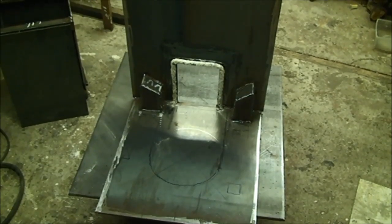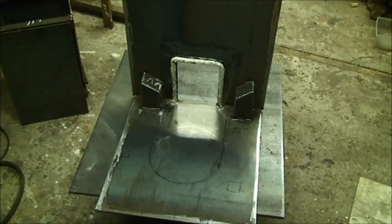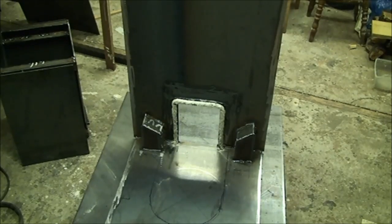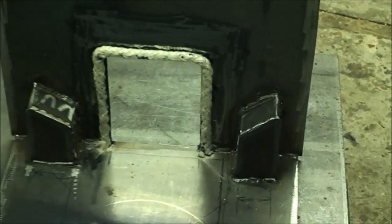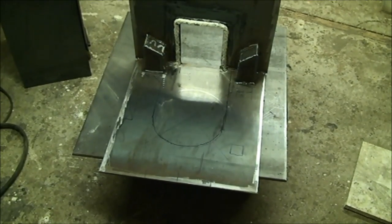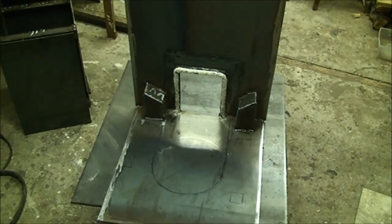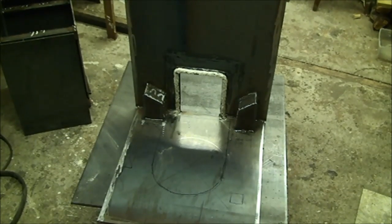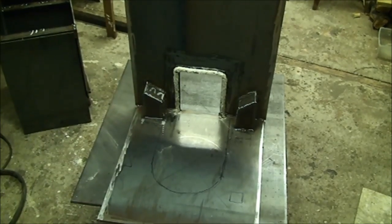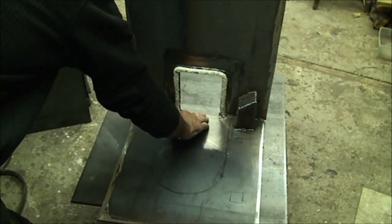The firebox obviously would be on the front of this, and there's a heat exchanger — it's a square exchanger. Those two little weird-shaped things there — I had to do them because I made a mistake on my primary air intake to the riser tube. It was a stupid mistake really: when I was planning it out, I hadn't thought about the ash pan restricting the airflow underneath, so it kind of left two four-inch gaps at each side.